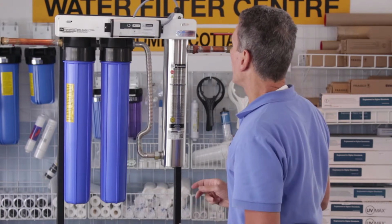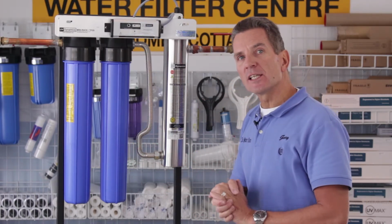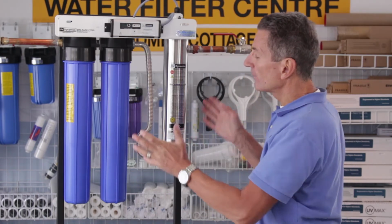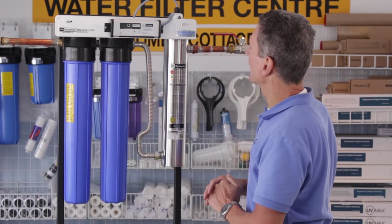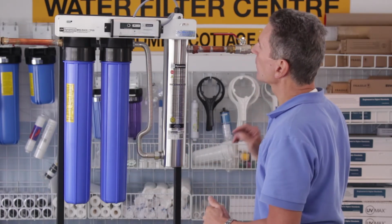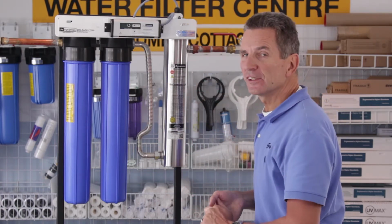Okay, so then the next stage is you have to disinfect. I have another video in this series that shows you how to disinfect an ultraviolet system. That's what you need to do at this stage whenever you install a new ultraviolet system. So you would do that now by putting chlorine in here. Anyway, you can follow that video, and once you've disinfected it, then you can flush out the chlorine, and the ultraviolet light will kill the bacteria, and you're good to go.